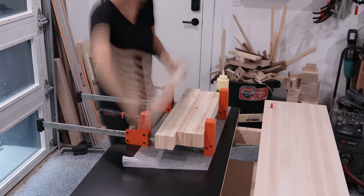I've seen torsion box videos where they sand all the support pieces flush after this step, but happy to report there was no sanding required here — all the pieces were smooth and flush with each other and running a straight edge across nothing was catching. On a high note from how well this was turning out, I decided to glue on the top. To get even pressure across the whole top I placed down another piece of plywood, then put cauls down, and since clamping long cauls causes the middle to bow upwards I put some thin scraps in there to force pressure in the center. However, there was actually too much pressure in the center — I'll show you that in a little bit.